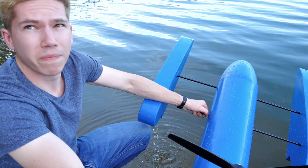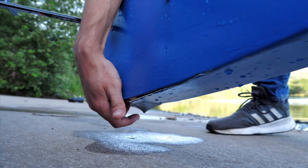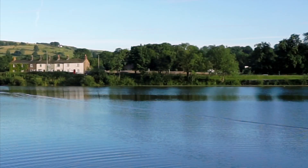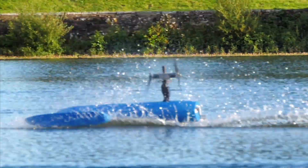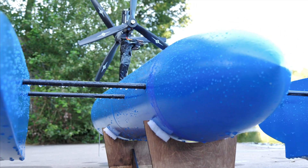We checked how fast it had been going, and then found the damage: the wood around the bottom had given way — my fingers shouldn't be in that hole. A sizeable force had been applied to the bottoms of the sponsons as they erode the surface of the water, which caused the thin balsa wood on one of them to give in. If I've written these floats off I can always build some new ones. This confirmed that we need to start moving beyond wood for this sort of application and onto more complex composite materials such as carbon — I might explore making some new floats in a future video. For now, I decided to do a bit more bodging, and appreciate the magnificent creation that is duct tape.